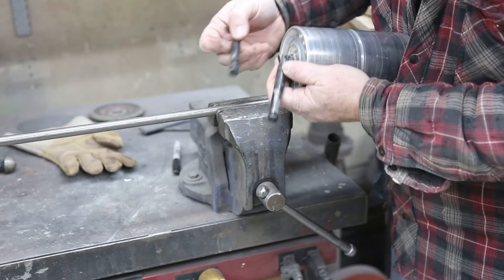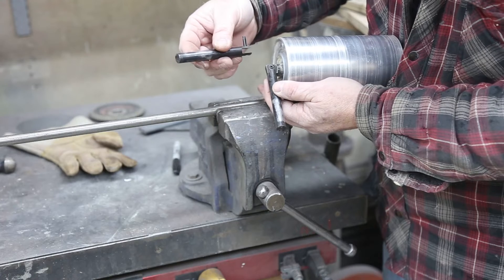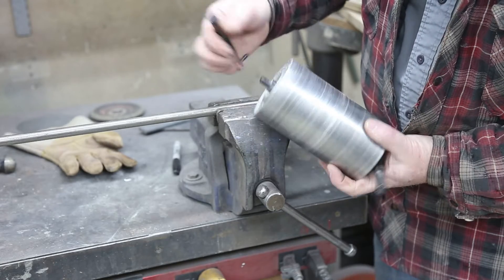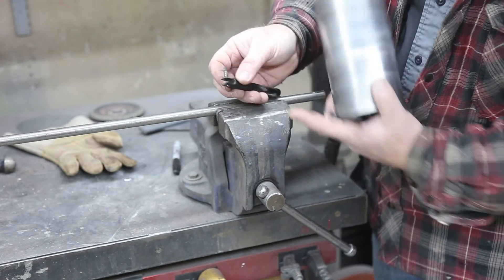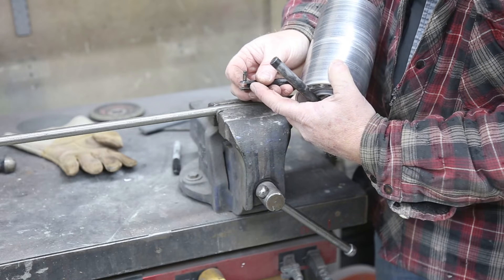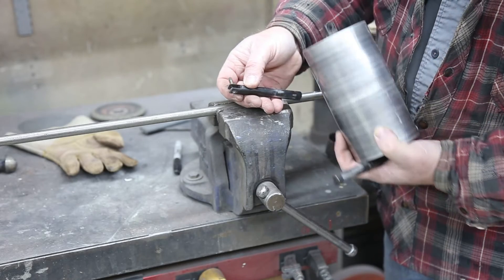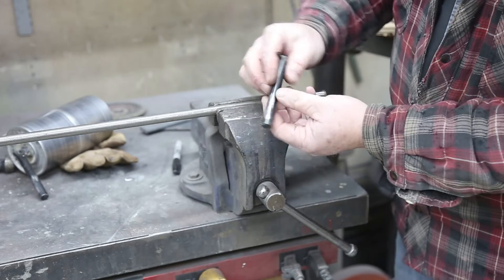So we're going to build — I don't know what you want to call those — some supports. I'm not going to modify the originals because I don't want to wreck them. I've got a piece of half-inch cold roll here, and basically where it hooks on is about a quarter of an inch thick, so we've got to cut a groove a quarter of an inch thick. It's five-eighths of an inch deep, so what I did was I drilled a hole one size smaller than a quarter right here. I drew some lines and I'm going to use a zip cut, cut that, then take my time with a file, and then drill that hole. The whole idea is to make these shorter.